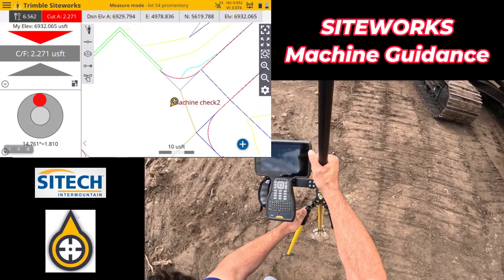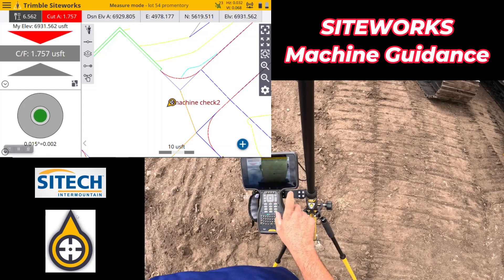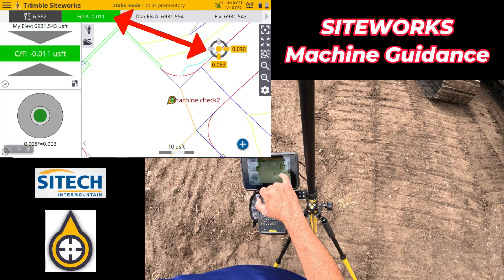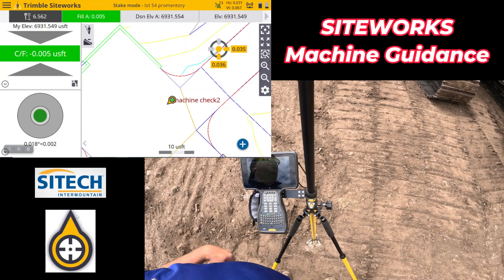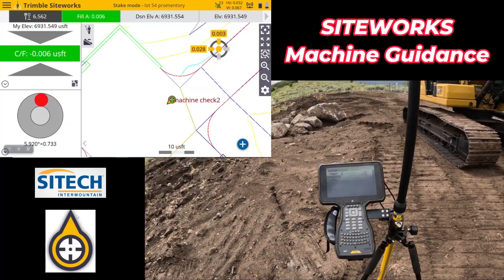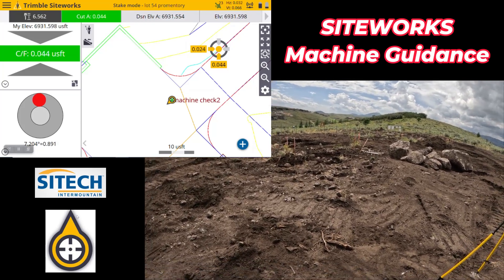I'm going to come over and set up on this rock that we just shot that point on inside the machine — right there on that rock. I'll go ahead and level up. I do have the tilt compensator on, but just to show you — we're leveled up, we're on machine control check two. I'm going to touch and hold on it, come in here, stake that point, and check how close we are. We are within two hundredths to the side, five hundredths one way, and the cut is within one to two hundredths of grade. That's how close it came right off of our excavator here, came right back to our data collector, shot that same point. It's a really neat system. One guy can cover a lot of ground — do it once, do it right the first time, and have the whole site to yourself.